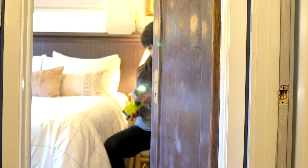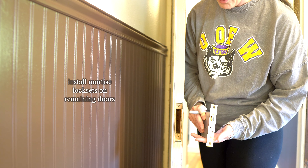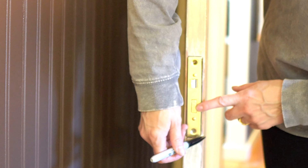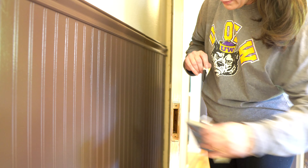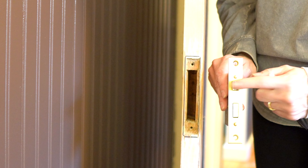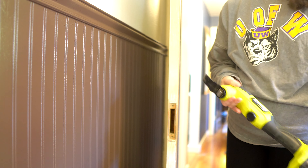We're back in the guest room. This door is clearly not prepared for the new mortise lock set. So I just stick it in the hole — usually at least that box fits in, at least in my experience so far. Draw a little line around it; now I've got my guide. As long as I can chip out the little borderline, I'll be able to fit it in easily. And I won't need to reverse this latch, but I will need to get in and do that on a couple of the other doors. I'll just use the multi-tool to chip away at it.